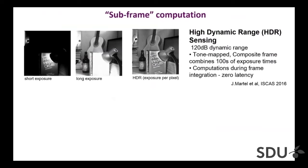There are other things you can do if you take this idea of subframe computation — doing a lot of computation before you output something. One basic thing is high dynamic range. A nice way of doing this is capturing images at lots of different exposures and deciding what gray level to output through some tone mapping function. At short exposure you only see bright things; at long exposure you see things in the shadows. If you combine them cleverly, you can see everything. There's a nice algorithm achieving all that using tone mapping, and it doesn't add extra time beyond the longest integration time — the computation for shorter-exposure frames happens during that integration period.